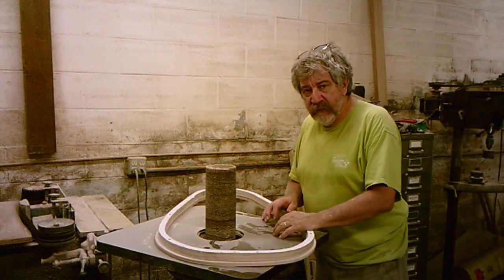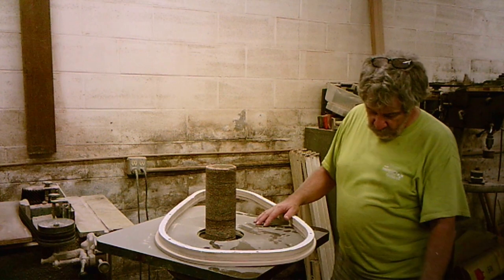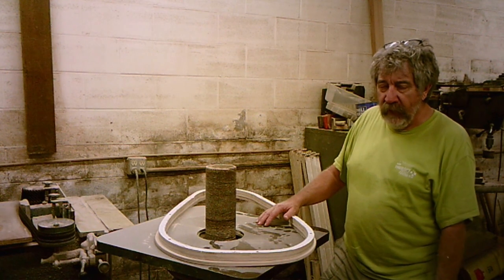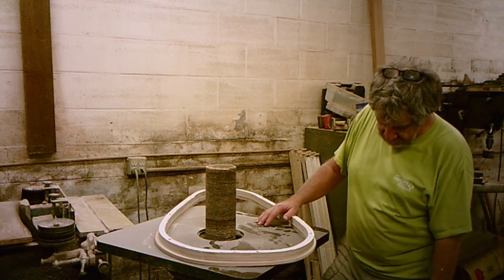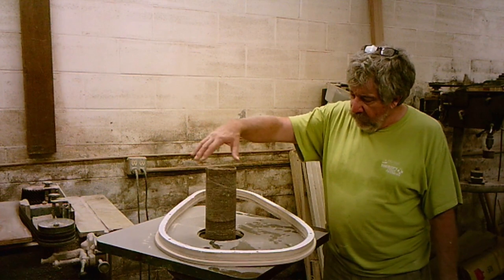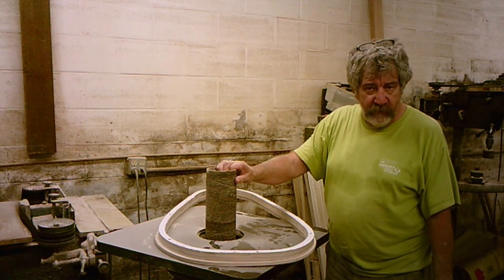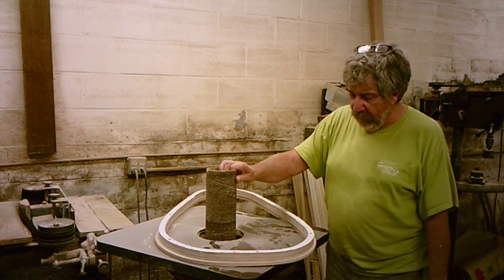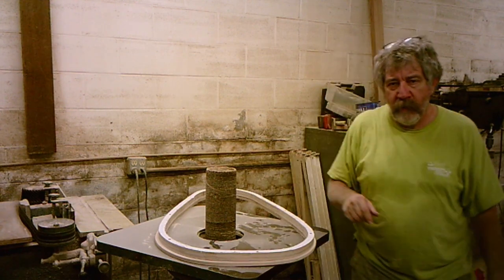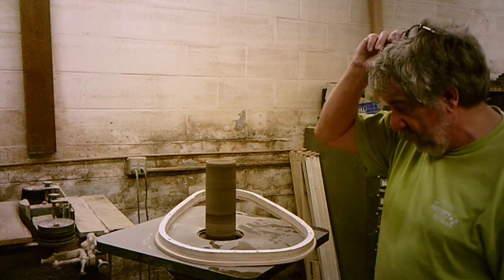This is my favorite machine in the shop — it's one I looked for for a long time. It is an industrial quality Max oscillating spindle sander. I got lucky; they're quite pricey. I found one local at a very reasonable price, well taken care of, with all the spindles for it. Got it set up right now with a three-inch spindle. This is like a 40-grit sandpaper — it looks like somebody glued gravel on here. Very aggressive at taking a lot of material off fast. I use it to sand the insides, and then I go back with a finer grit. It will take the hide off your fingers in a heartbeat.